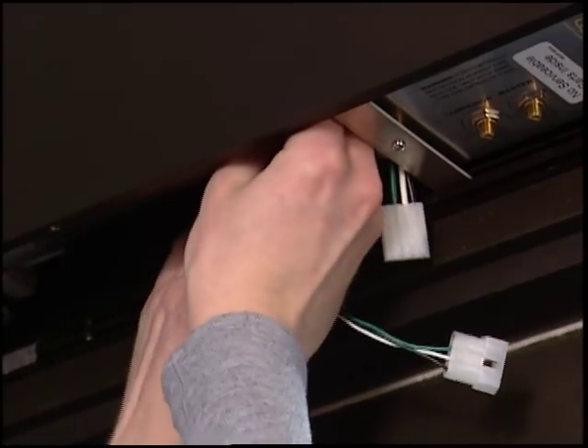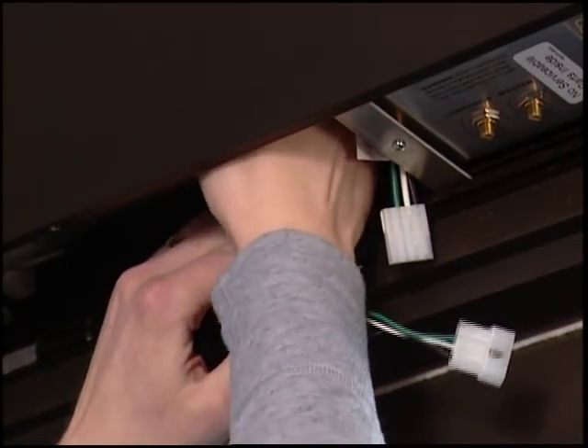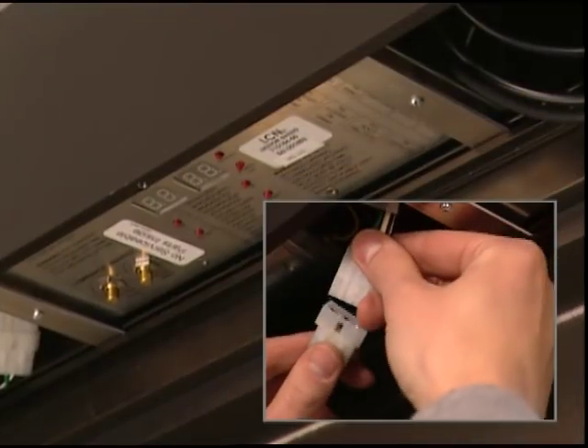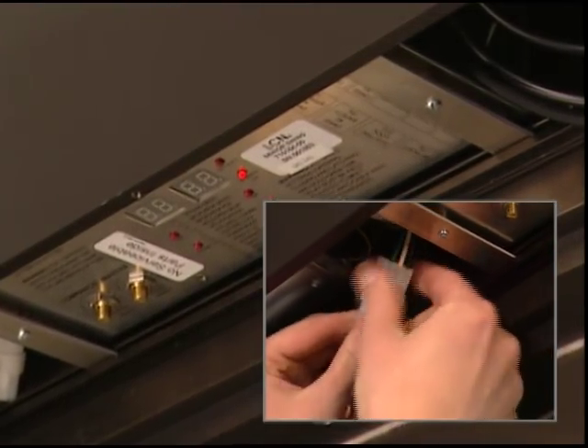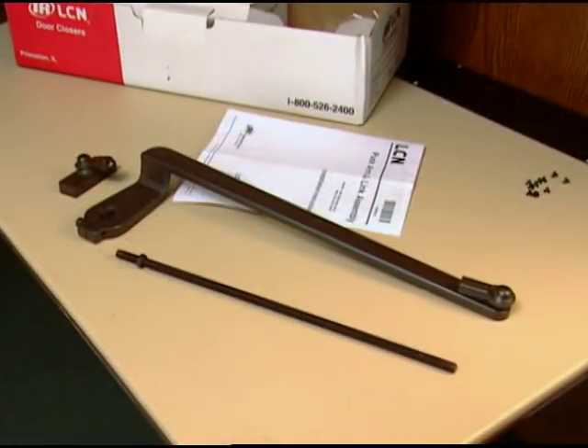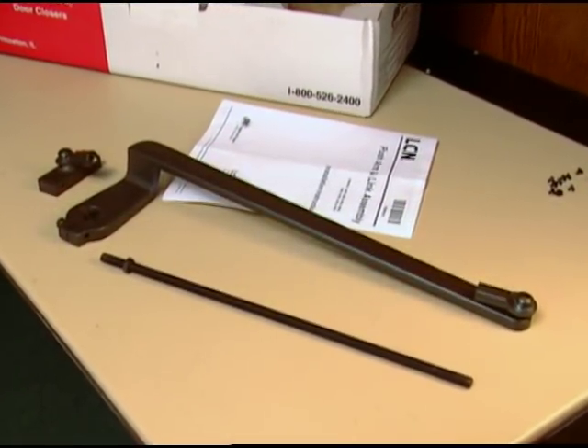Rotate the mounting bars to slide into the groove slots until the control box is in place, then tighten the screws to secure the unit. Next, gently position the motor gearbox wiring harness over the motor. Be careful not to pull or push on any wires as that can disconnect the wire from its terminal and result in a malfunction. Connect the six pin connector plug from the motor gearbox to the control box. Finally, connect the AC power. The red indicator light will come on when the unit is connected properly.